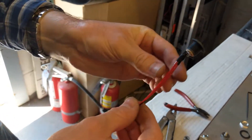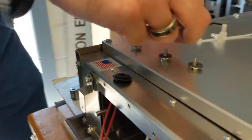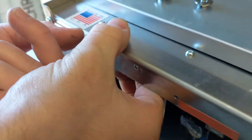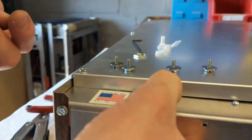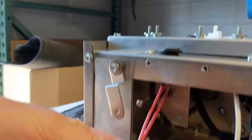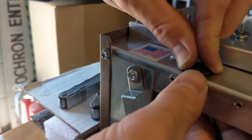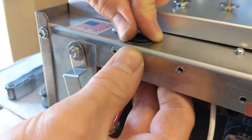We are inserting the power jack through the hole. The black fiber washer goes on. The higher up you can get it with your fingers, even if you can't see what you're doing, the better it will be. Then you're going to affix it with that nut, and this is where the thin-walled 14mm driver comes in handy. There's not a lot of room in there.